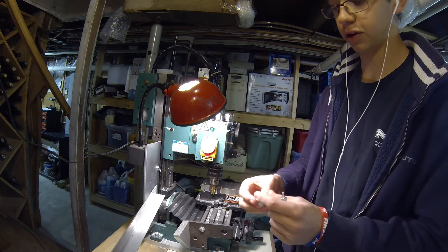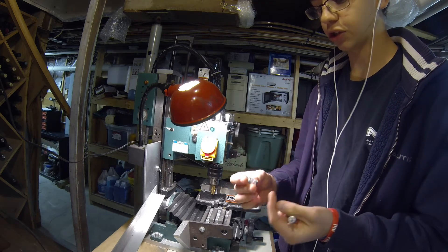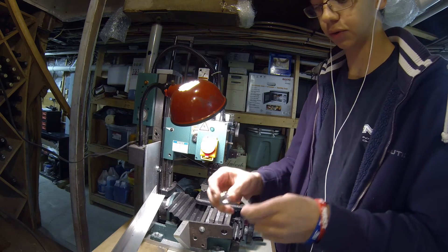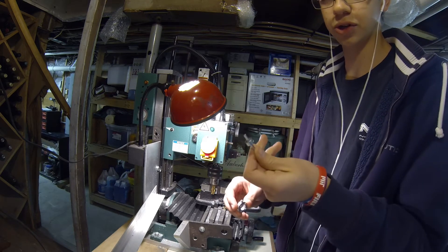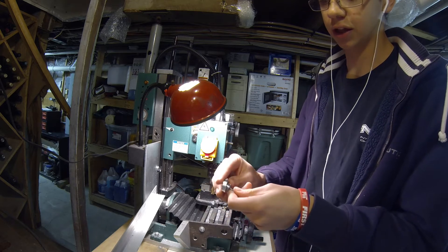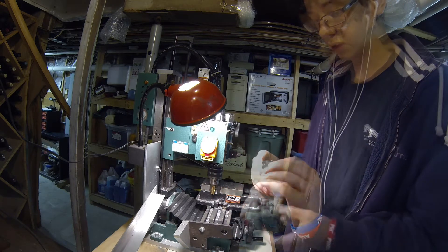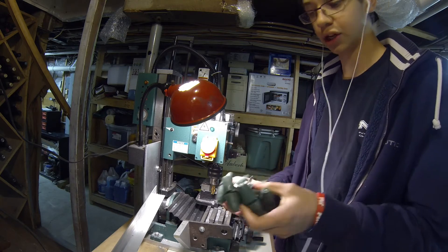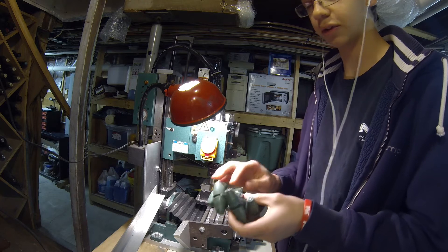This is a piece I made earlier where I drilled out the center of a regular Tetrix axle hub so that it would fit a VEX axle hub. The VEX axle hub screws onto the VEX axle, and then the Tetrix axle hub screws onto the VEX axle hub. This allows us to center the Tetrix axle hub onto the VEX mecanum wheels.